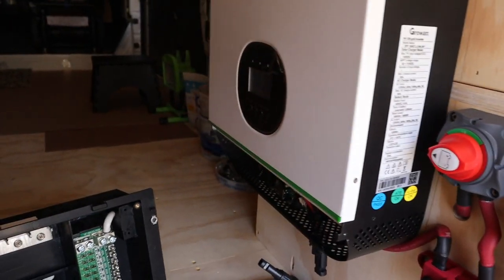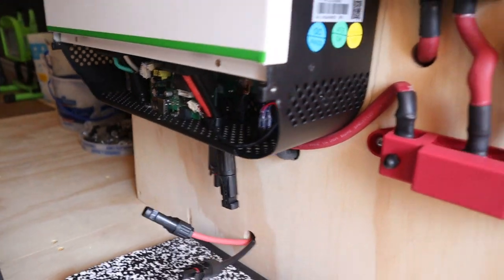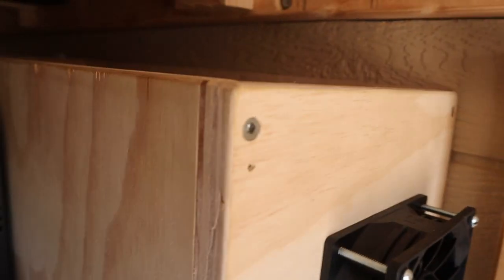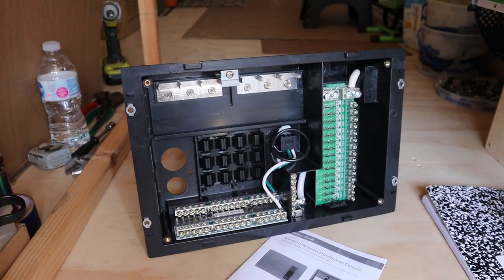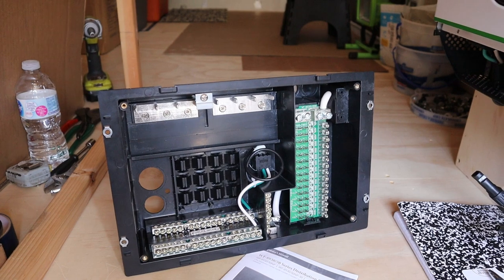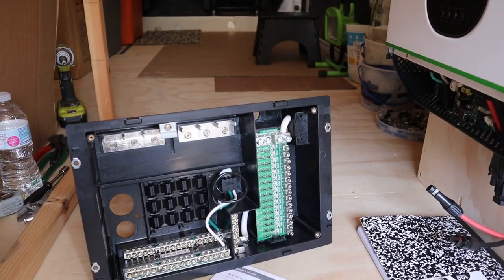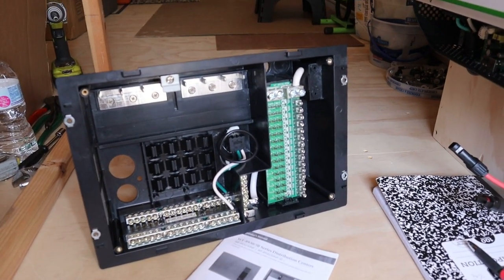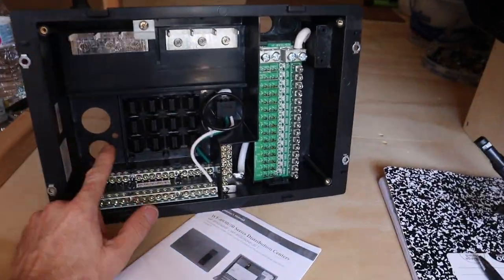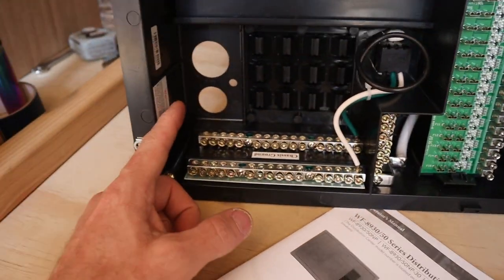I do have my GrowWatt installed. I need to get my breaker panel installed and then I can install my batteries and then test everything to make sure it's working properly. I'm gonna do the best that I can to show you how I install this breaker panel and hopefully it's helpful to people out there doing any kind of off-grid solar, a van build, or maybe a small cabin. So first I'm gonna feed all my wires through some of the holes in the back that I've punched out. I'm gonna feed my DC wire on this side and then my AC wire on this side.